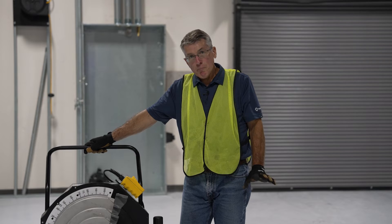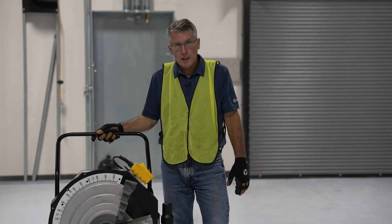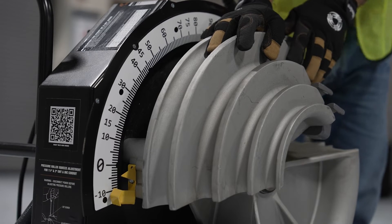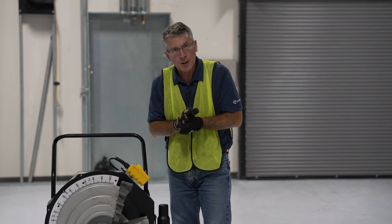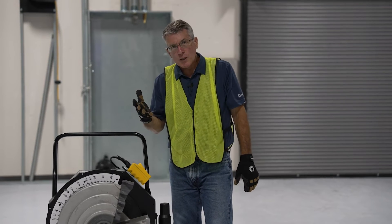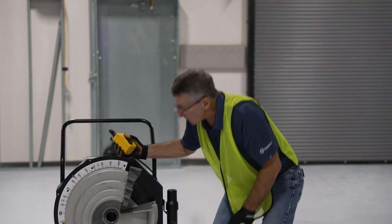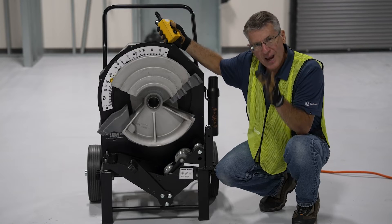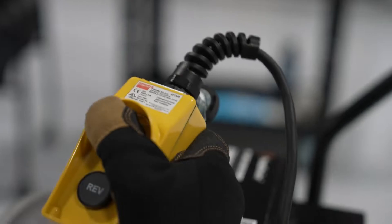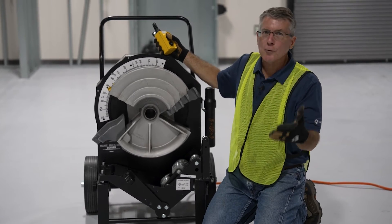Inside the MSB2000, the motor is controlled with a variable frequency drive, or a VFD. A VFD is very different than mechanical relays because it gives you very precise control over the movement of the shoe. When you're bending conduit, you want the bending shoe to stop on a dime so that you get an accurate bending angle. Or sometimes you also want to be able to move the bending shoe in very small increments and kind of zero in on the correct bend angle. Notice how as the bending shoe is moving and I release my finger off the forward button, the shoe stops immediately — that's an advantage of a variable frequency drive motor. I can also move the bending shoe in very small increments until I just get to the bend angle that I want to achieve. That's the advantage of variable frequency drive over mechanical relays for a bender like this.